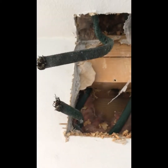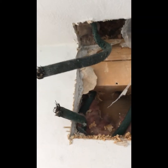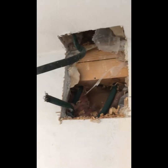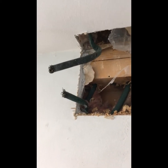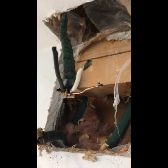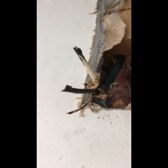Do your research on these Federal panels. Don't be afraid to go online and type in Federal Pioneer or Federal Pacific breaker panels — you'll find a lot of really good information, and it's scary, the problems these panels have. Here's the proof right here — look at that, burnt right up. We're going to fix this now. I'm actually going to eliminate this cable altogether and refeed that circuit from the basement, remove all this burnt wire, get the wall patched up, and then I'll be talking to the homeowner about replacing that panel. The shorting happened from the hot to the neutral and ground — all three wires are burnt up completely. For that to not trip the breaker in that Federal panel is just so scary.